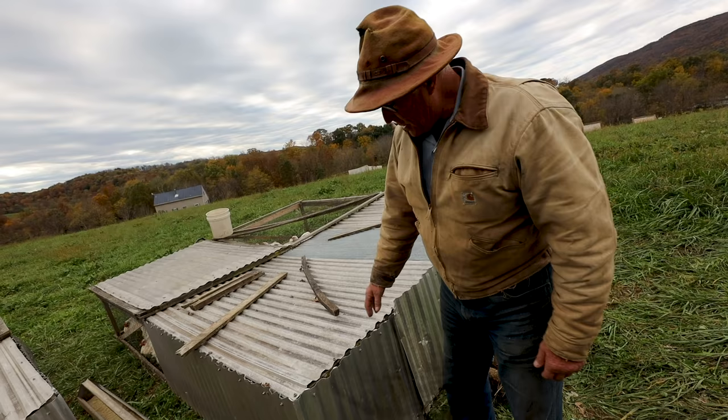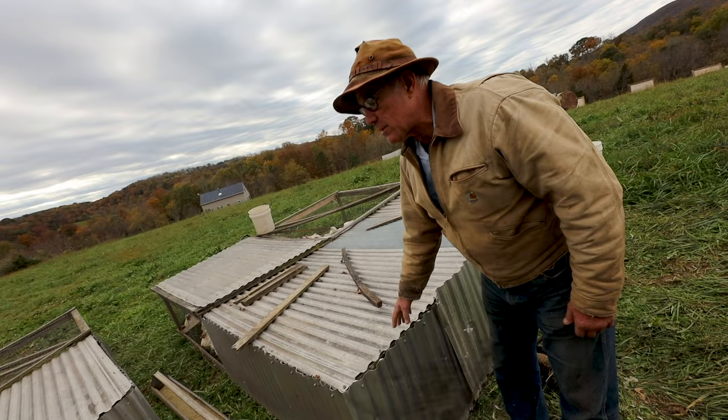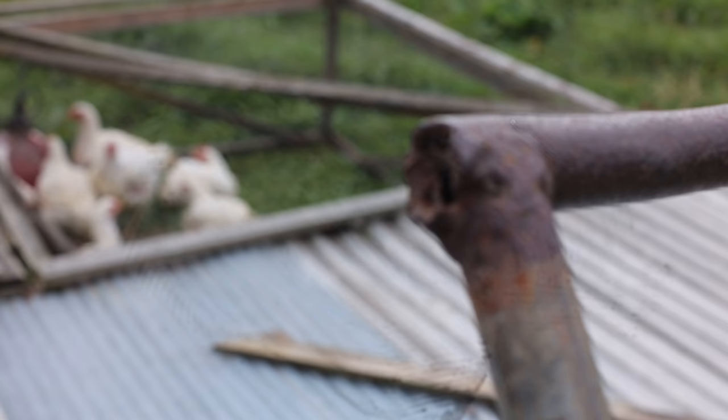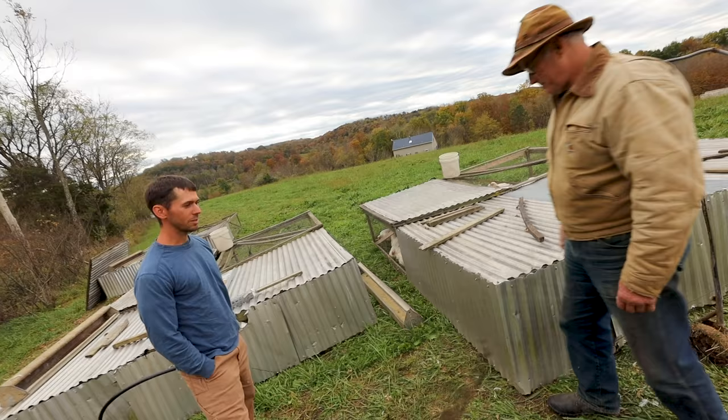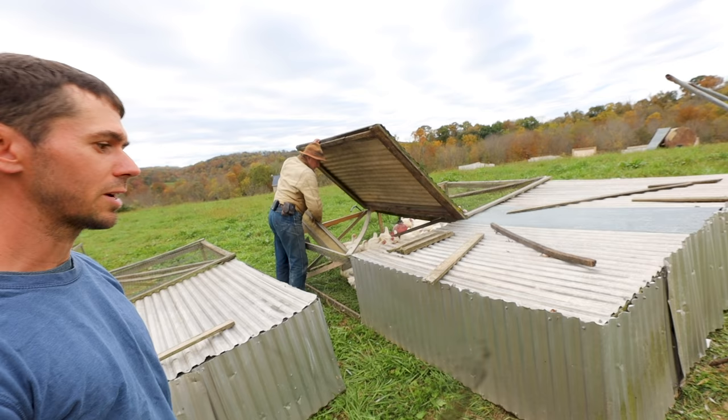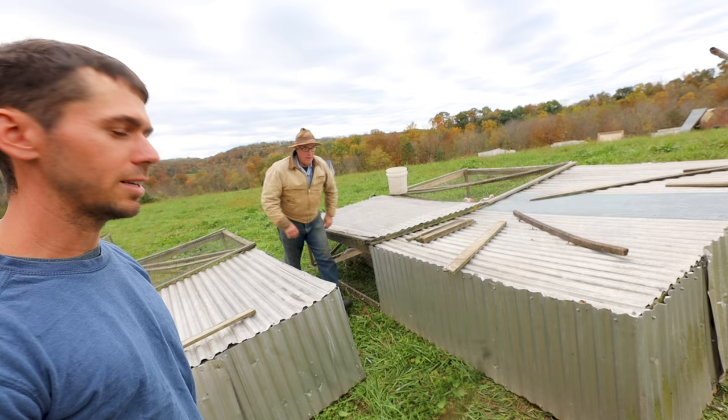And Chris understands the engineering behind this aluminum. The aluminum actually, as a metallic thing, is different than steel. And maybe he should address that. Yeah, I believe the material property that we're looking at is emissivity. And the emissivity of aluminum versus steel is about 4 times different, meaning that it will absorb 4 times less heat energy than steel would.